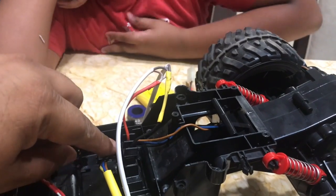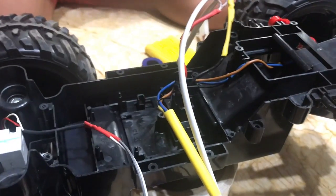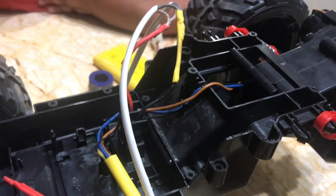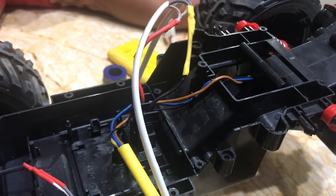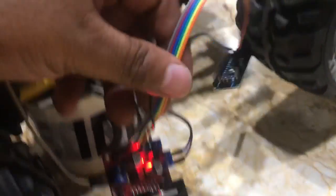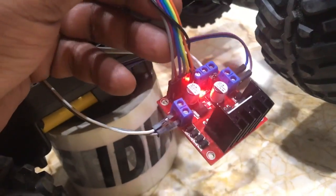The brown and blue wires are the positive and negative wires of the motor. If I reverse the polarity of the voltage, the motor will rotate in the other direction — giving positive voltage to brown rotates it one way, and giving negative (zero volts) to brown rotates it the other way. We used a flat ribbon cable to connect the DC motor controller to the Arduino board.